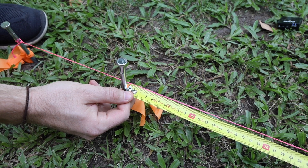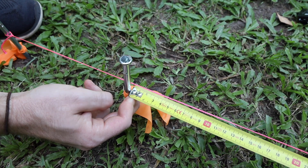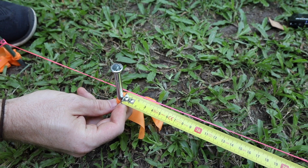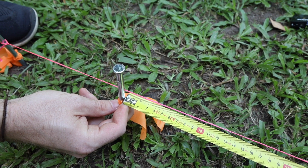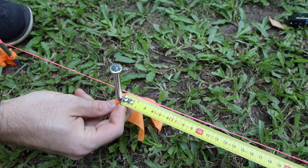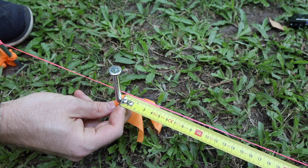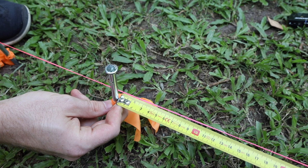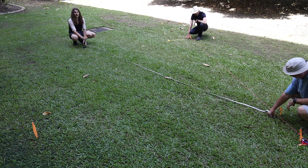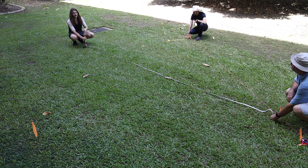Be careful to check where the zero point on your tape measure is, because it's not always the same on every tape. Use a thin peg and have the end of the tape right up against the starting peg. If you're off by a couple of centimeters, all your other measurements will be complicated. Now we do the next corner: five meters on the hypotenuse, meeting the three-meter length.